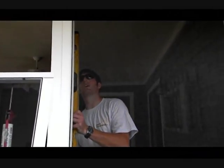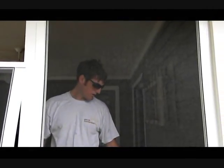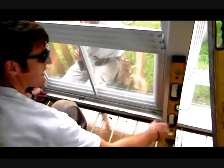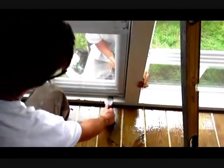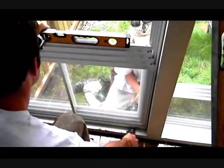The first thing you are going to do is just kind of drop the unit in the hole. You might want to check both your posts, both sides, to see how plumb they are. In this case, this post looks pretty plumb, so what you'd want to do is somewhat center the unit in the bottom of the hole so that you are able to adjust it side to side if you need to. We've centered the unit in the hole, tried to keep an even reveal on both sides, and then we take the level, put it on there, and use something like a chisel to just raise up your unit until it sits level.